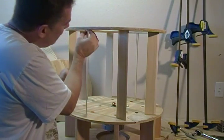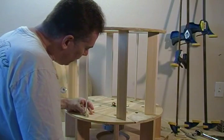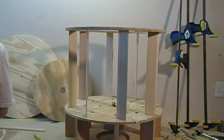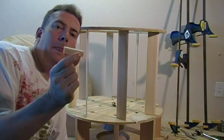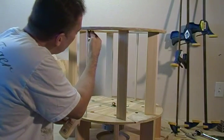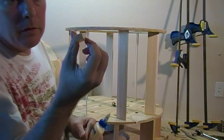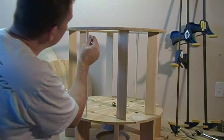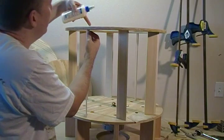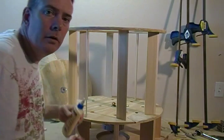What we're going to do is glue these up into the corner, next to each of these stators and to the ring, and down at the bottom here as well. I'm going to be gluing these all the way around on the back side - you can glue it on both sides. I cut these about two inches. When you take the square side and square it in here, it's a molding material. When you glue it in here you want to make sure that it does not encroach inside of our circle at all. If you're not paying attention and you cut them too long, they'll stick out and rub on our rotor, so we don't want that.